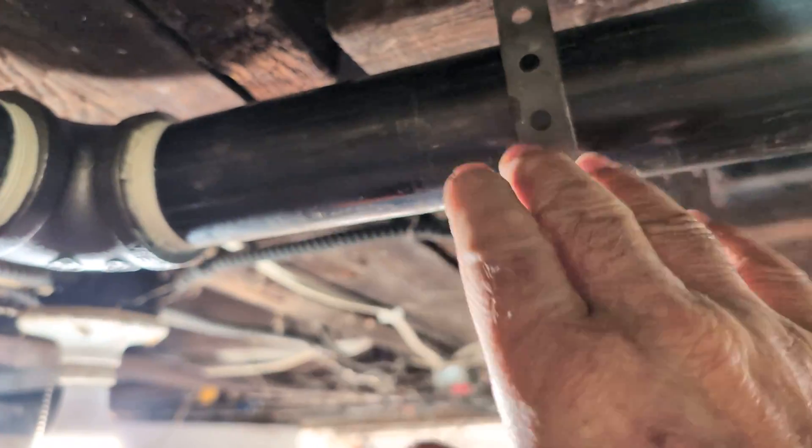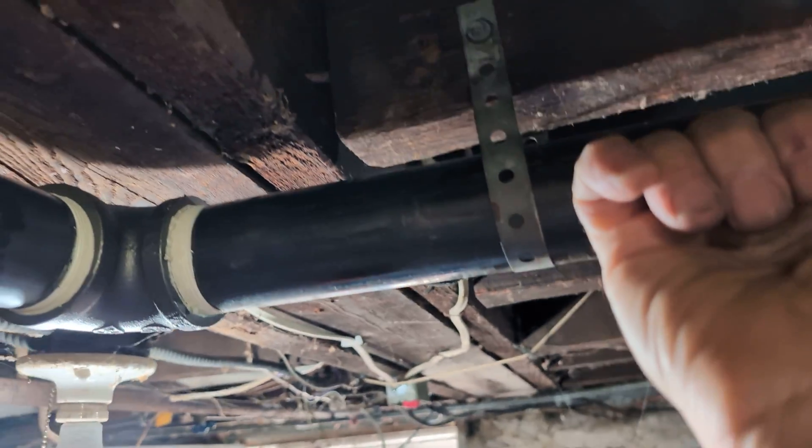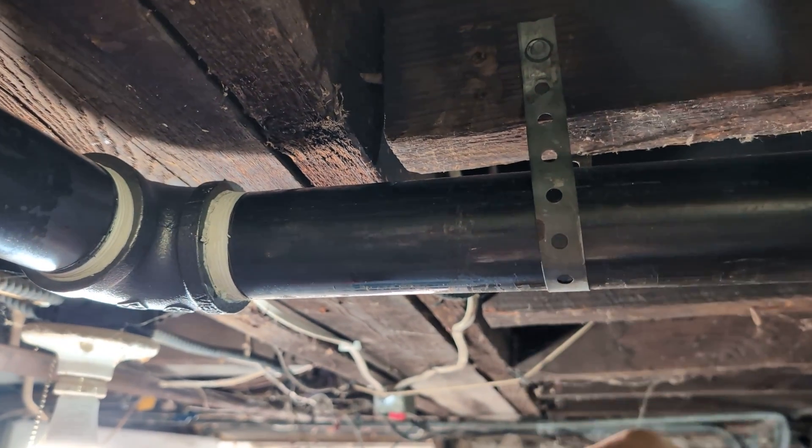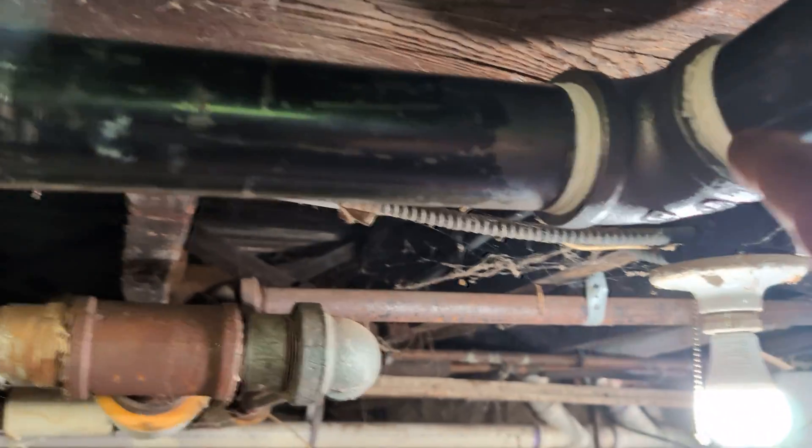This is parallel flow, where the steam, the air, and the water are moving in that direction towards the end, where the water is taken off and sent back to the boiler through a dry return, which then turns into a wet return.